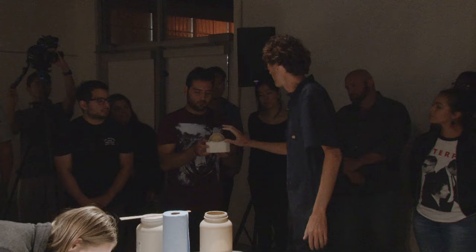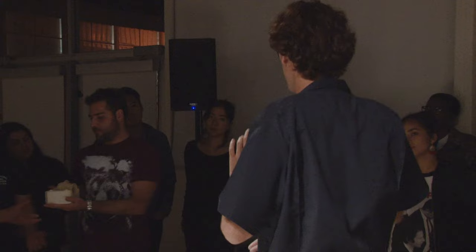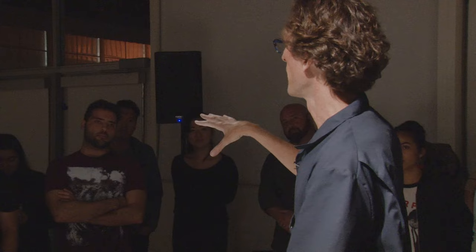You can touch it. Basically, what'll happen is over the next 3 hours or something like that, it'll get cooler and cooler as more of the water evaporates off of it. So that same idea of evaporative cooling is at play here. And it'll stay cool for the next couple days potentially. As soon as it's not cool anymore, that means the moisture content of your clay has equilibrated with the moisture of the ambient air, right? So that means it's probably a good time to put it in the kiln.